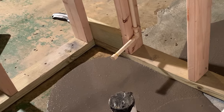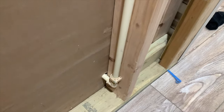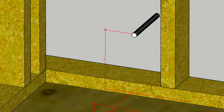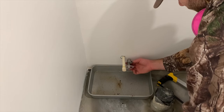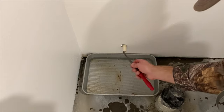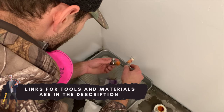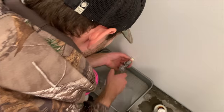As far as the supply piping, the contractor installed half inch CPVC, which is going to connect to the toilet fill valve. In terms of where to position this, move it six inches over and then seven inches up where you want to position that pipe through the wall. At this point I went back, installed drywall, and painted the walls. Then I cut off the supply pipe at a distance from the wall to accommodate the angle valve — obviously shutting off the water supply first. After cutting the pipe, I deburred any rough edges, then applied PVC primer and CPVC glue and pushed the angle valve into place, holding it for around 15 to 30 seconds to make sure the solvent weld is strong.